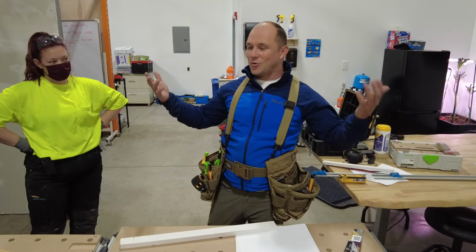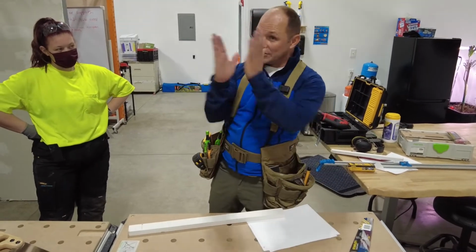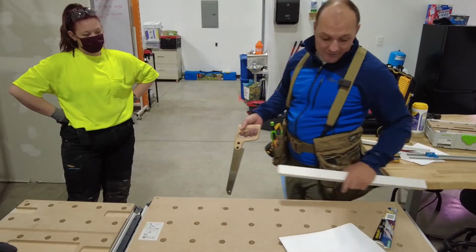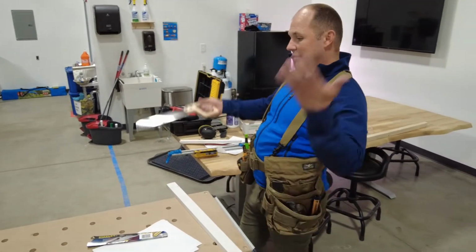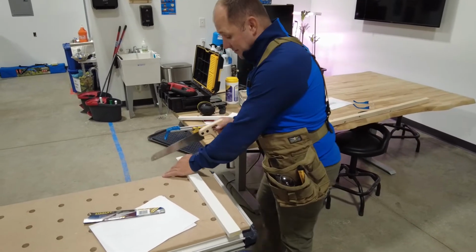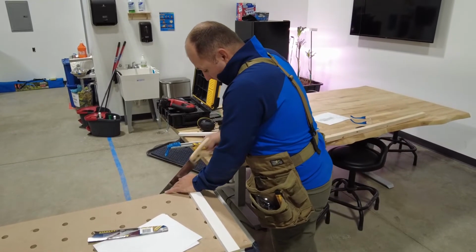If I'm framing a house, it's 1/4 inch, 1/2 inch, because everything's gonna come after. Drywall, it's probably a 1/2 inch. I can be 1/2 inch off, we're gonna mud it all. Trim, probably a 32nd, right? Cabinetry is probably less than that. You gotta make sure that you have the tolerances in mind for whatever you're doing, right? Attic insulation, we're an inch here, it doesn't really matter, right? It can't be a foot. Air sealing, it has to cover everything, right? And so understanding your allowable tolerances is a big deal.